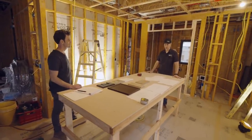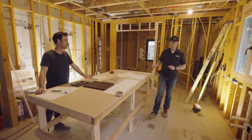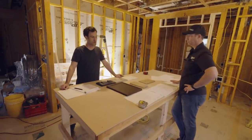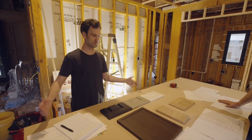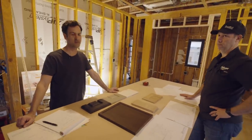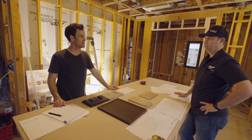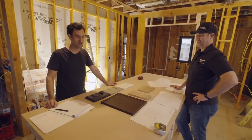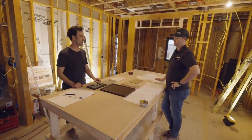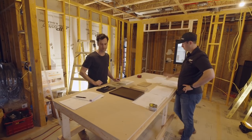We did place the order already for these cabinets, and you'll notice we're still in the rough-in stage — and yet my cabinets are on order. Really critical to think about this ahead of time. For anyone who wants to do this: if you can mock it up in foam, do it. A couple hundred dollars worth of pink foam from Home Depot, some tape, it's super easy to cut — you just make boxes and walk around. The order's been placed but it's not in production yet, so we have a couple of weeks where we can say let's pull two inches out of this — we lose a little storage on one side, no big deal. I also want to mention we have pendant lights that are going to come down and light the island space — figuring out the height and location would be really nice.